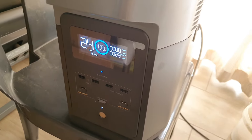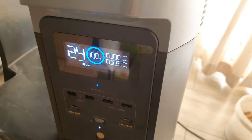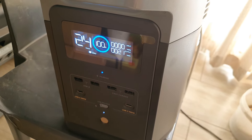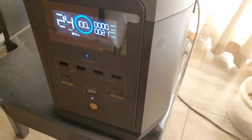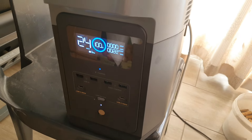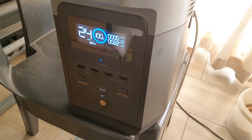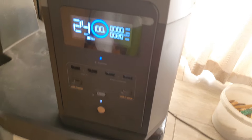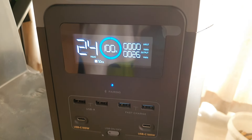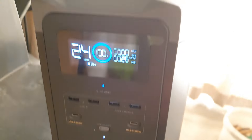When I came back and plugged in the solar cable, it showed 89% and charged at 300 watts for a few seconds, then I saw the overload message again. I was scared my EcoFlow was messed up and I checked all over YouTube — there was barely any useful information. But that overload message just means your battery is actually full.